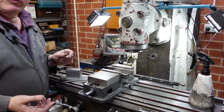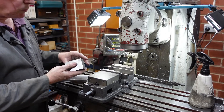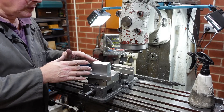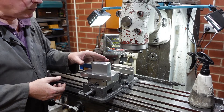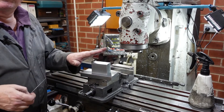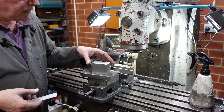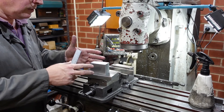I've been through my material pile and found some bits of stock. This is actually some black bar — I've just cleaned up all the faces, squared it up, and all that. When you're designing something for yourself, it's better to have something close to your desired size that you can take a little bit off, rather than specifying a size that's just a little too big, which means starting with the next piece up and taking a lot off. I wanted around 40–42 mm here and I found a piece of 40; cleaned it up and I get 39 out of it, and I can adjust my dimensions to suit. You need to be conscious of the material you've got and specify your sizes to suit.